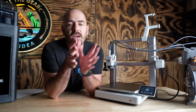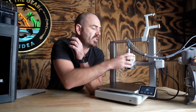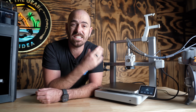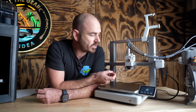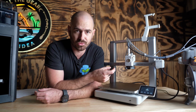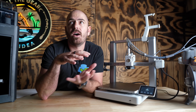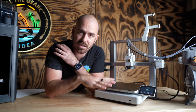Another quirk that we discovered after running these machines for thousands and thousands of hours is that the first layer of the prints will start to deteriorate because of a known issue with the print head that requires you to tighten the screws behind the extruder unit. I'll leave a link in the description for those people that are running these non-stop and come across this first layer defect on the print bed. I'm also going to show you how to fix that problem a little bit later in the video.